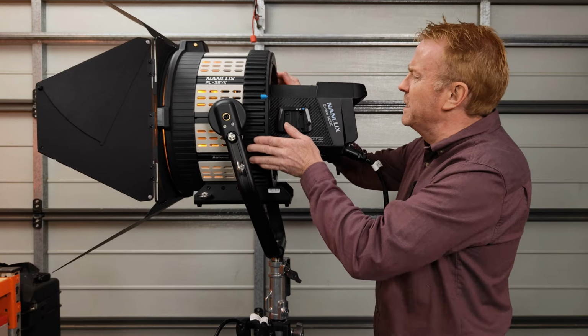Here are the results between 8000 Kelvin and 20,000 Kelvin taken at 1000 Kelvin increments. And the lowest score here is a 91. But just note, at 20,000 Kelvin, I can't give you a score because a CCT this high is outside the parameters for doing the test.